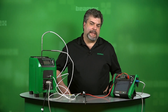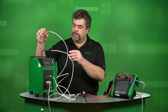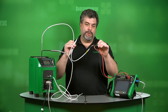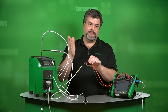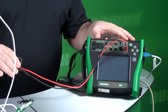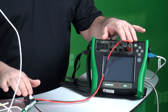To do an automatic calibration, we need to make the connections. We'll start off with our temperature element that we're plugging into our temperature source. That connects to our temperature transmitter. The transmitter converts this temperature into a milliamp output. The calibrator then measures that milliamp output, and at the same time we can provide 24 volt loop power back to power up the transmitter.